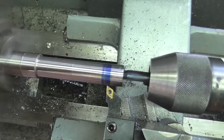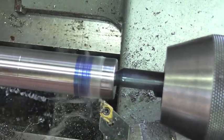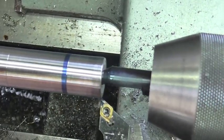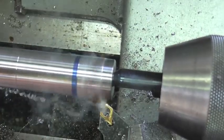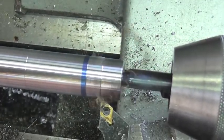The two prototypes I made out of mild steel aren't going to hold up, so I have this grade 8 bolt and I'm going to make the one we're showing in the video. I'm going to toss it in the forge, bring it up to critical temperature, quench it and harden it, and then temper it back.